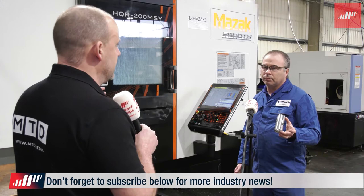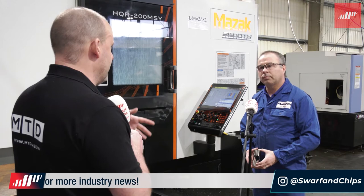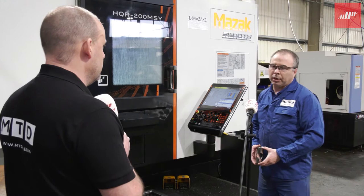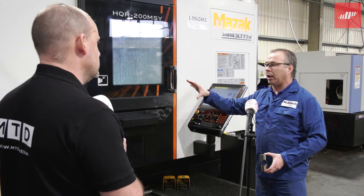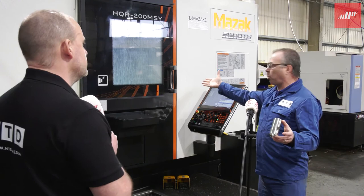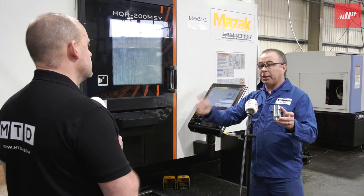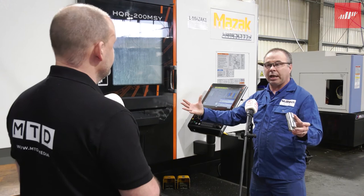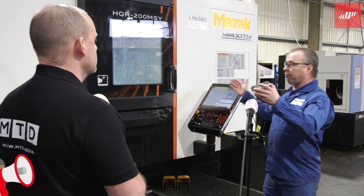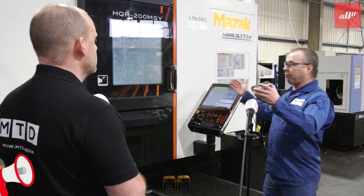This is like a vending machine as well, like the other two solutions we've looked at. The amount of tools you can have preset on there basically allows you to go from job to job pretty quickly. On this machine at the moment, we're only using one spindle, but because we're doing a variety of jobs at the same time, we have the ability to load both turrets up with more tools than we would on any other machine — probably about 20 tools set in this machine. That gives us the ability to just load a program, hit the button, run a part, load another program, because all the tools have been set for all the jobs simultaneously. So we could probably run 10 to 15 jobs that use the same tooling, but only because this machine has those capabilities. We've used one spindle but both turrets to get that extra productivity out of the machine.